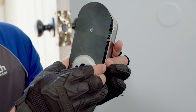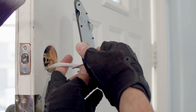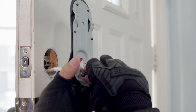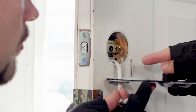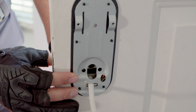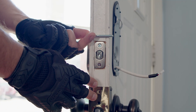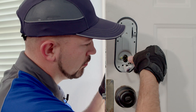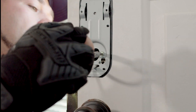Now let's install the inside portion. Detach the mounting plate from the back of the lock and install it on the door. Be sure to hold the cable firmly to keep the outside keypad from falling out. Pull the cable through the bottom hole. Align the mounting plate pins with the holes on the deadbolt. Ensure the keypad and mounting plate are aligned vertically with the door. Secure the mounting plate using the screws with the right length for your door.